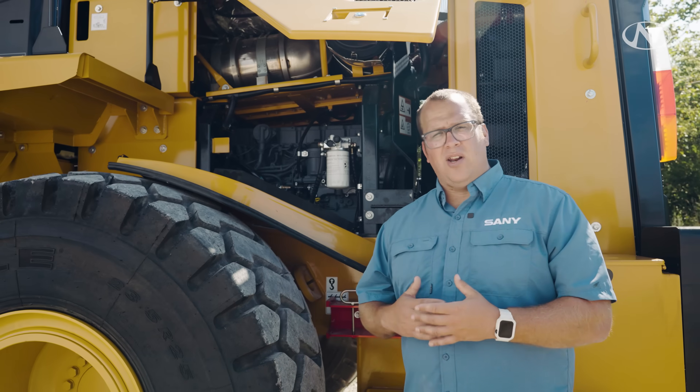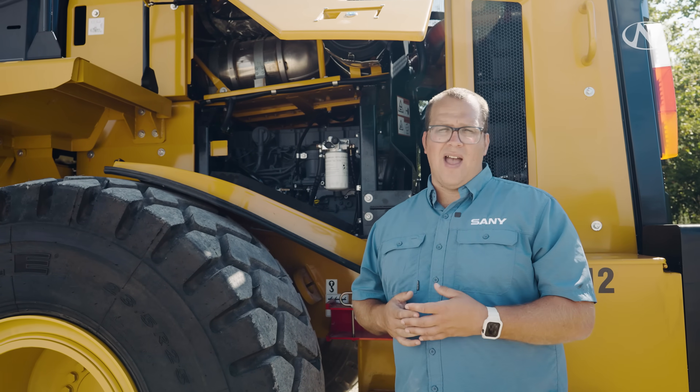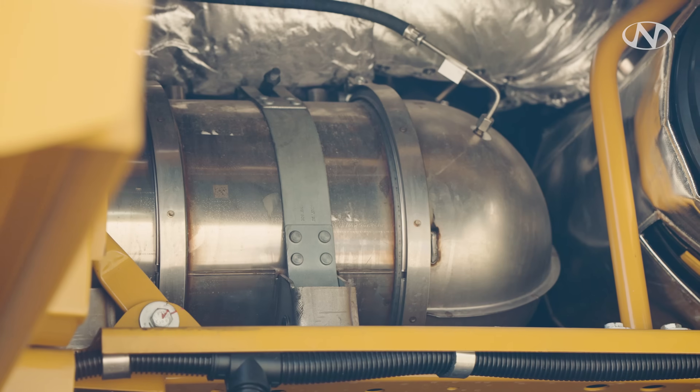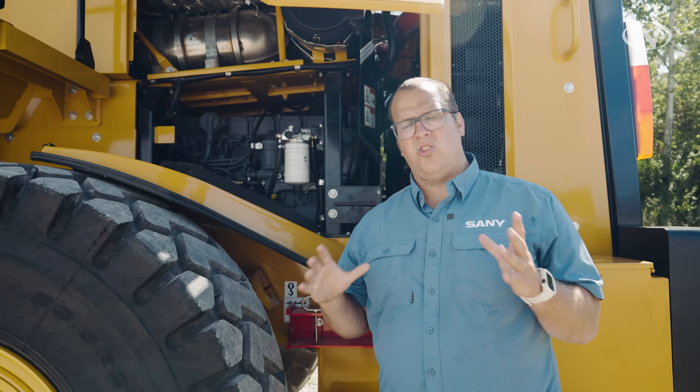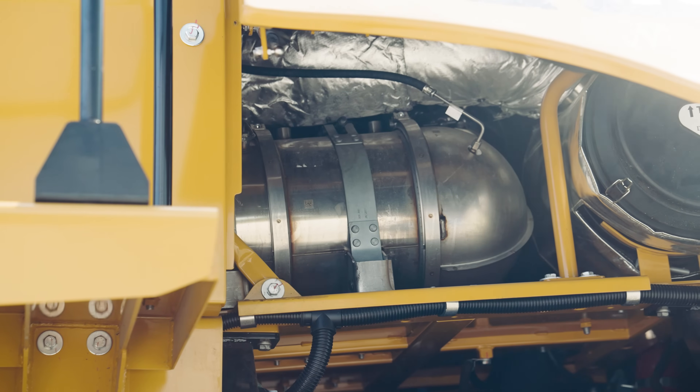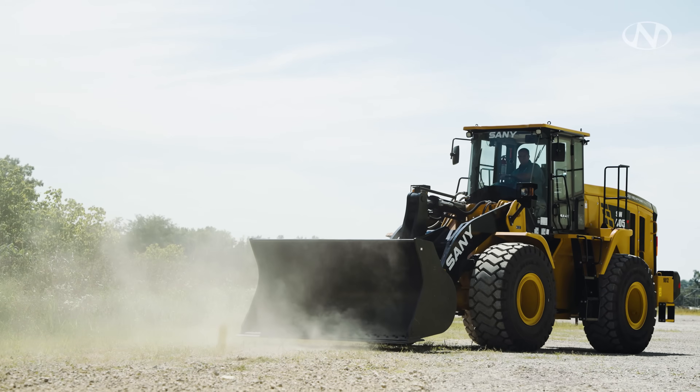Other things located in this area include our coolant sight glass, engine oil filters, water fuel separator, and our DPF system. Check to make sure there's no trash buildup around the DPF — it gets very hot. Take an overall broad-view inspection of all these items.